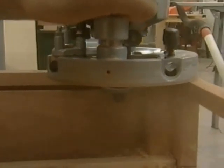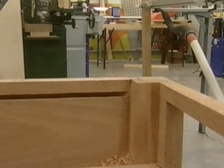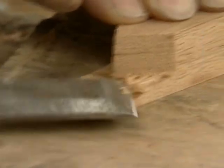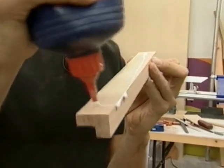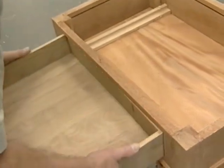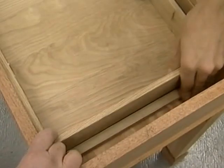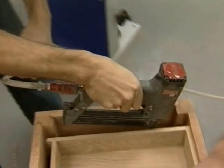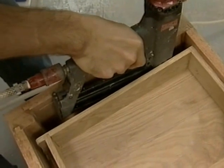To secure the top in place, we need a groove around the inside of the table, and make some buttons that fit into the groove. A little bit of glue. To give the drawer a smooth action, we're putting in two runners. And once in position, we'll secure them with nails — just sneak it down there, and that will hold it in position until the glue goes off.